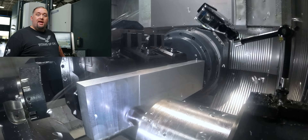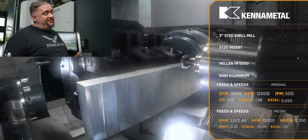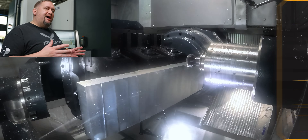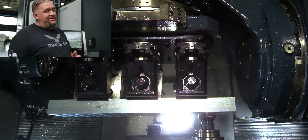Let's make some chips. Now if you're watching this you may wonder why I didn't take my face mill left to right, because it would have been faster. I'm going up and down because if my stock is shifted over an inch or so, then my face mill is going to hit my trunnion — and we don't want that.